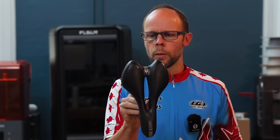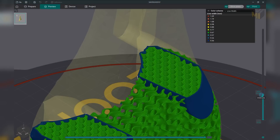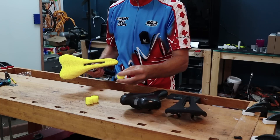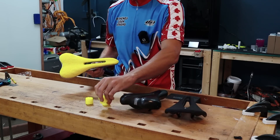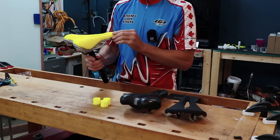The second saddle, which is supposed to be more comfortable, is a two-and-a-half out of five — I didn't need to get out as much, but by the end of the ride everything was hurting quite a bit. Not particularly comfortable. As for the 3D printed one, it turns out I didn't need to get out of the saddle at all. It was a little uncomfortable in a couple of spots, and I think that comes down to my choice of infill properties — I used a thicker line width and should have gone smaller. A 0.3mm line width gives nice cushion, 0.4mm is still fairly cushiony, and 0.7mm has very little give. I ended up going with around 0.65–0.7mm, so there's room for improvement, but I'm overall pretty happy with it and I'm going to continue using it as-is.